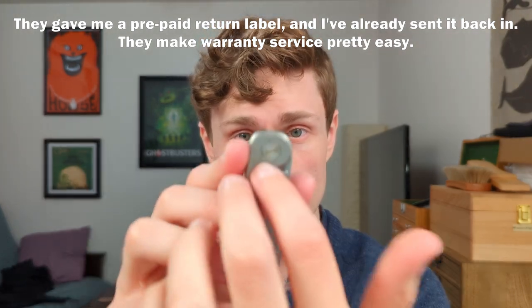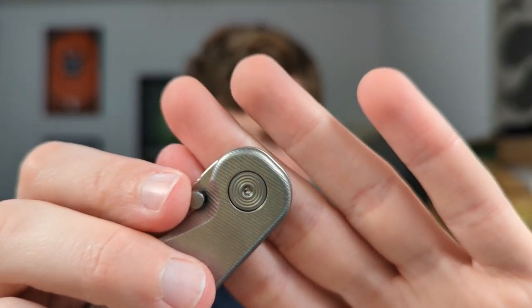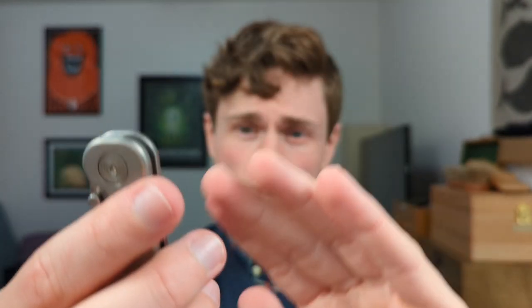One of the things that they did that's really cool is they made this a captive pivot now. My favorite kind of captive pivots are the kind where there's something about the actual show side of the pivot itself that makes it not be able to spin. I don't like the full D-shaped pivot bar as much because it creates a pocket for gunk to go into. So I really like the fact that they flattened out this edge bit right there. I was worried when I first saw that because the pivot on these just looks so cool with that stripe pattern — I was a little nervous that this would look like it was messing up that perfect concentric circle thing. And it does a little bit, but honestly I think it looks really nice. I also know that they switched over to using caged bearings; they were using loose bearings in the original. So that is a quality of life improvement I'm really excited to see them do.